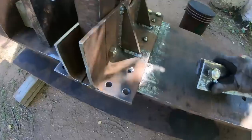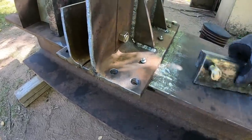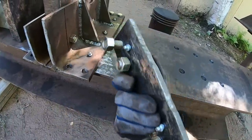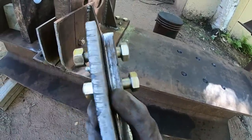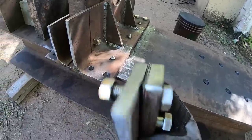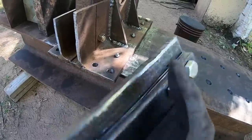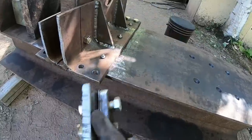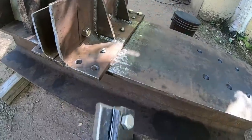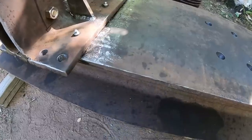Clamps around the 5/8 leg of the H-beam. We have 3 5/8 grade 8 bolts going through each half, and we have the guide plate, and there's all the clearance shims between the plate and the bottom clamp portion. And I've also drilled, you can see the grease there, 2 grease passages that will feed grease directly into the joint between the bottom plate, this guide plate, and the table, and the edge of the legs.